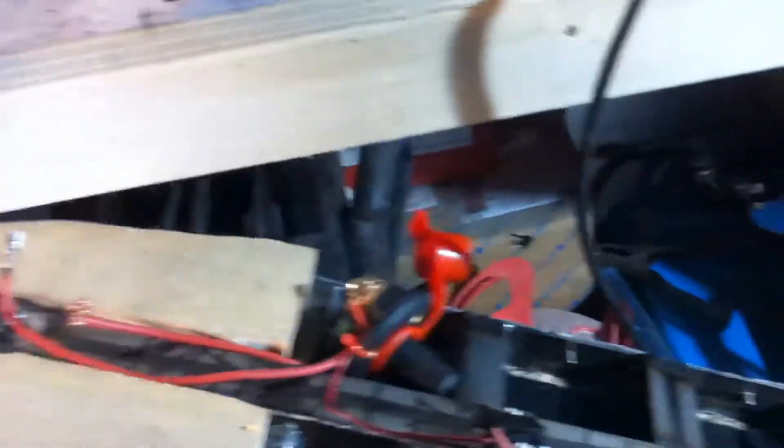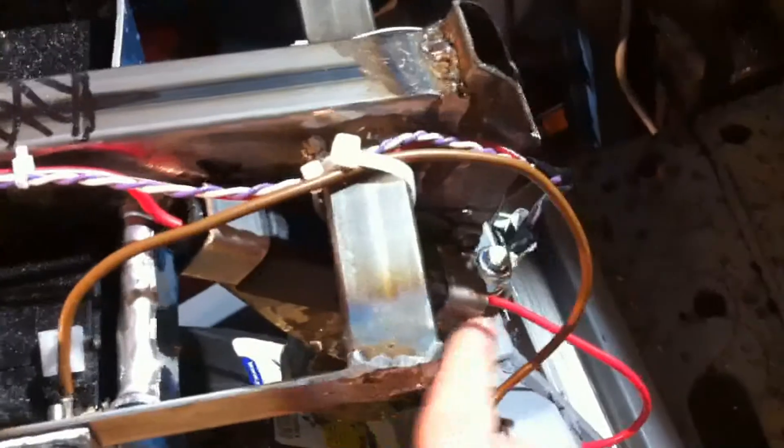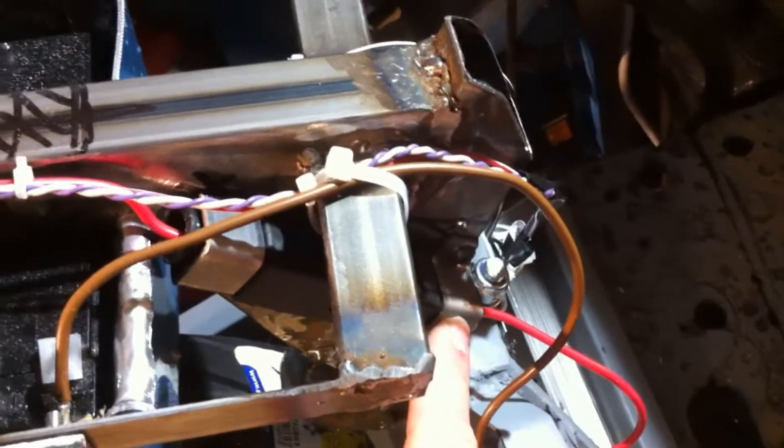This is to mount the box with the Arduino and the balance system in it. We've got a master power cutoff which needs to be mounted, a row of batteries, steering linkage. What I've been doing since the last episode is cramming in all the electronics and these rather bulky plug connectors. Coming up to the top end, you can see there's various wires — this is ground, this is the power lead, this is a gigantic fuse inside this holder held on with some clamps, and this is the 0 to 5 volt line to tell the Kelly controller how much power and in what direction to send to the motor.